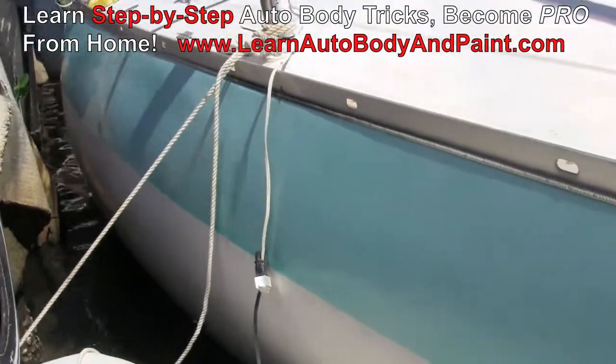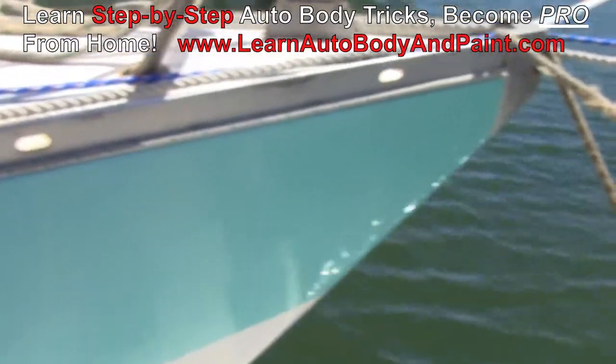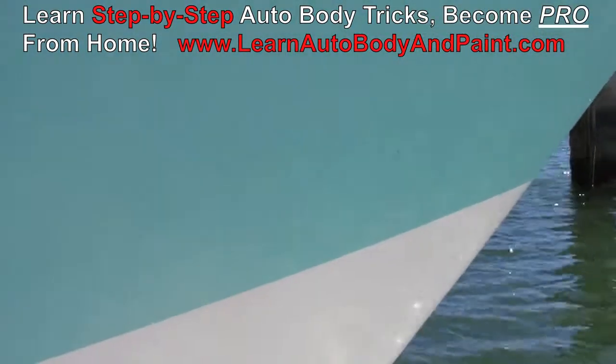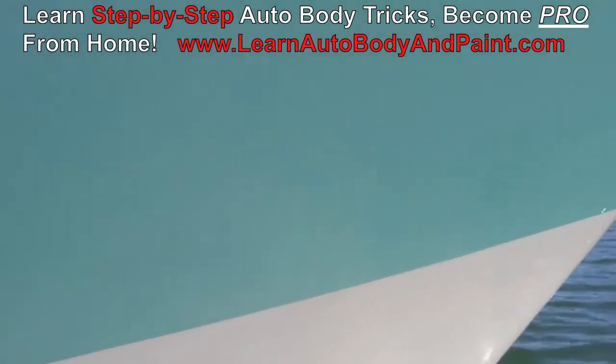We're working on a sailboat project here. As you can see, there are a lot of water spots on it — it looks really dull. You get this problem with cars too, if they've been sitting outside for years and never buffed or waxed. This is how it'll start to look before peeling. It's very dull looking with a lot of water spots, and 95% of the time simple buffing will take care of all this and make it look beautiful again without repainting.